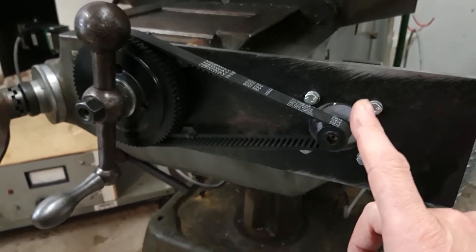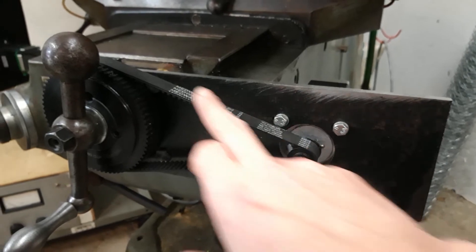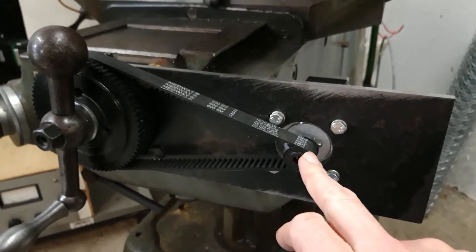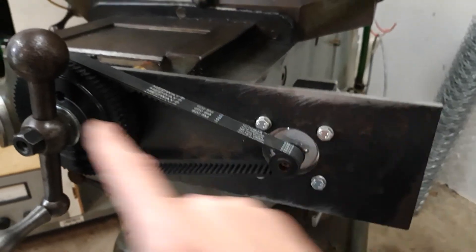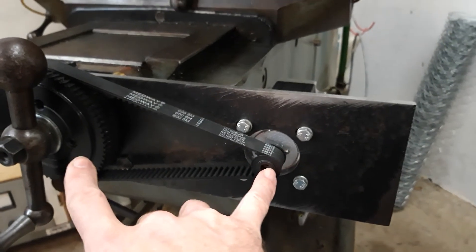So there's your little shopping list if you want a 6-to-1 ratio. The more reduction ratio you put in, the slower the machine will go, but the more torque you can leverage from your stepper motor. And sometimes more accuracy as well, because every step of the motor turns this a less distance, so you can increase the accuracy.